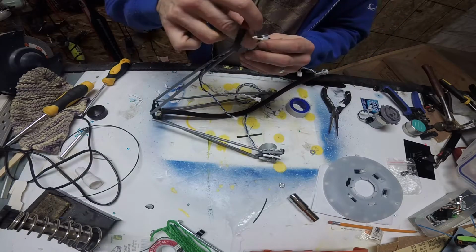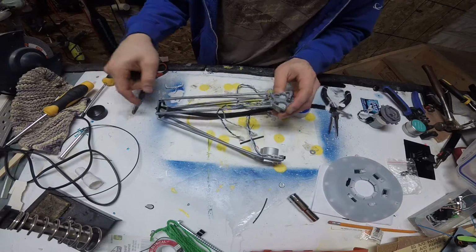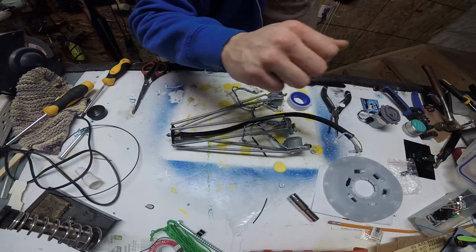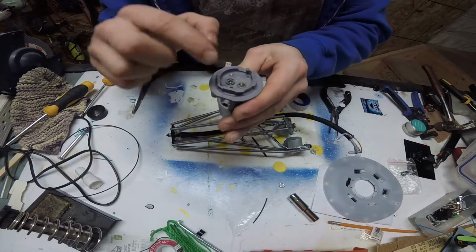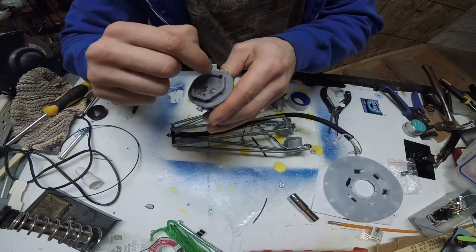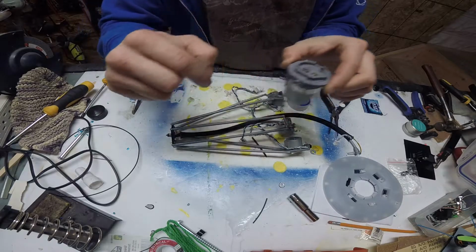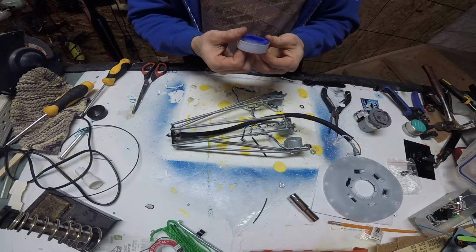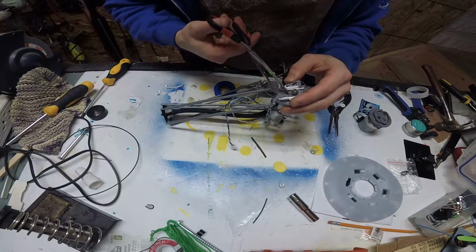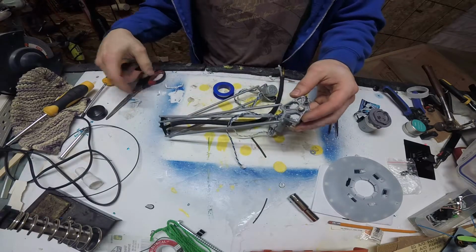Now I'm done crying. I took it all apart. I managed to get the filament out from here. I took a blowtorch to it. I'm not kidding. And I heated the end. I just pulled the filament out. This here, I made a bigger shim this time that'll more closely fit the actual hole that's been carved out by the gear. I greased it up really well this time. Made sure that even if it does move, it'll still keep contact with the filament. And I am taking all of the stuff that I put on there before off, and I'm trying it again properly. Cha-cha! Cha-cha! With a steady cam.